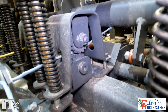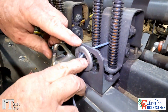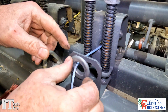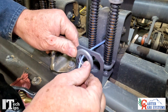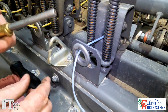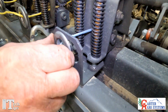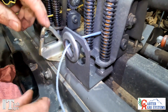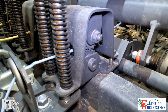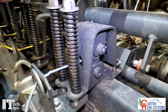After you've spun the top and bottom, go ahead and lower this back down. This is your twine guide right through here — you want to make sure where this twine has been rubbing that it hasn't worn a groove in here. If it has, put a stone on your die grinder and you can grind this out. Always make sure these will turn good and free. Hit it with a little air to blow out the dirt and free it up even more. Check inside on your tensioner rollers — over a period of time they're going to get grooved out quite a bit, so you'll want to replace those.